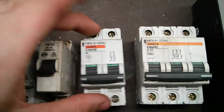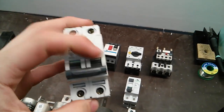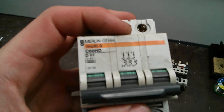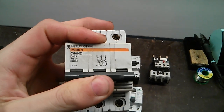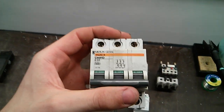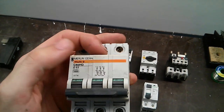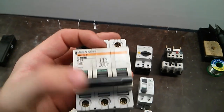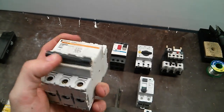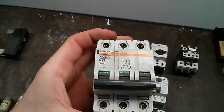We've got a double pole — you usually find these on 110 volt circuits, things like that. Sometimes they put the live and neutral through those two. And we've got the three-phase circuit breaker — this one is 63 amps, it's a type D. That can handle a pretty nasty type of inrush current — several tens of times higher than its rating for a certain number of seconds. You get those graphs in the BS7671, our wiring regs over here — the characteristic curves showing these ratings, so you can work out what you really need. Generally type D is quite extreme, special conditions only.